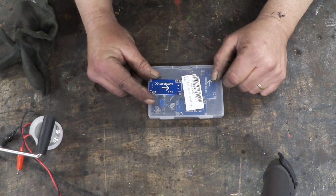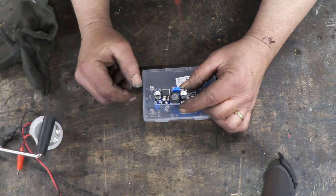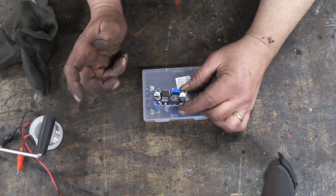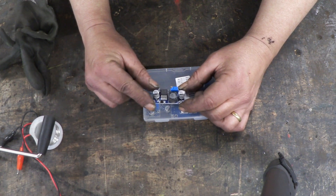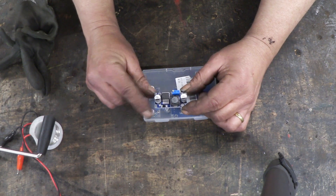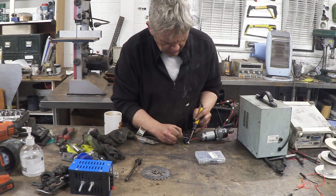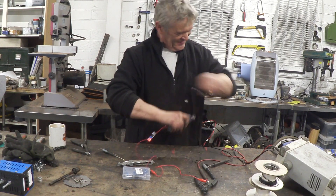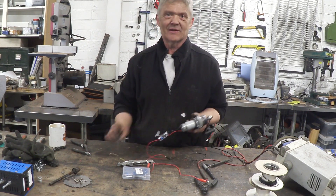Your big old arrow telling you which way is in and out. Now I bought what I thought was appropriate for this — a few amps and a range of voltage. Most of them are in that kind of price range, about a pound or two, but they have a huge range of amps they can cope with, and I guess you buy the one to suit your needs. Anyway, let's solder in some wires and see what we get. So once we've soldered that in we can give a good old turn. There we go — a stabilized voltage of 5.2 volts, which I set by turning that little brass screw.